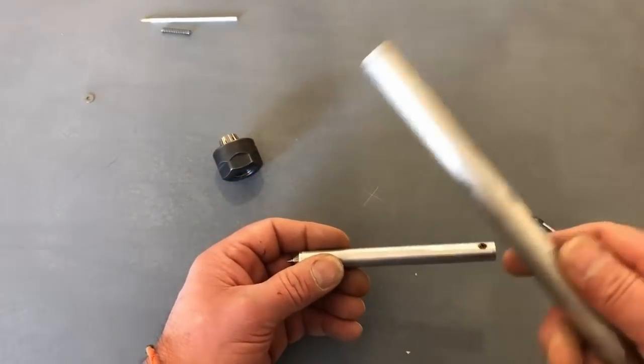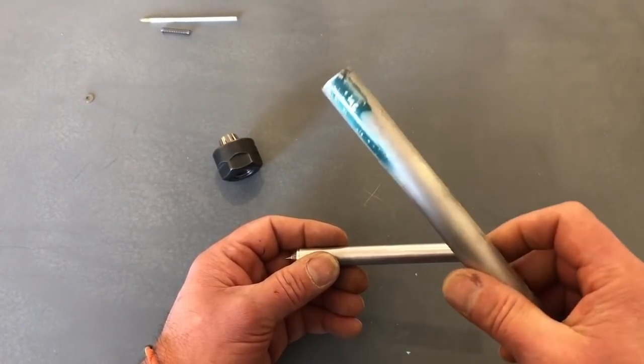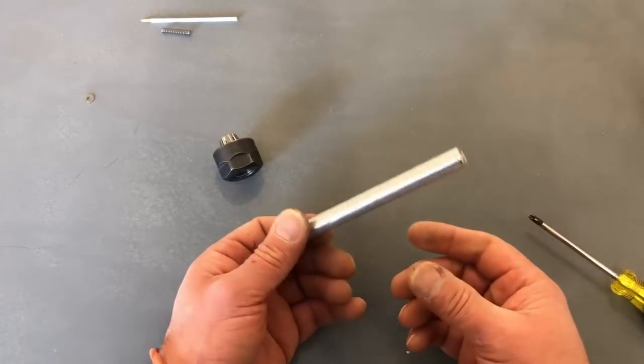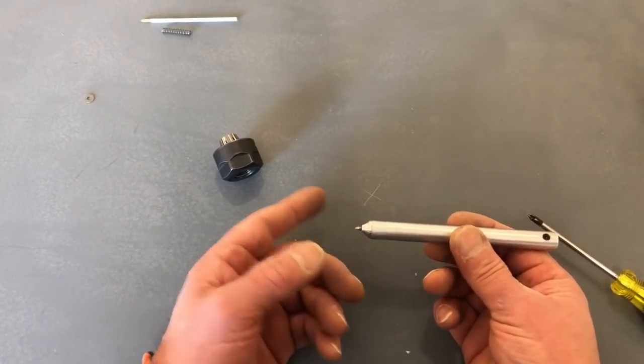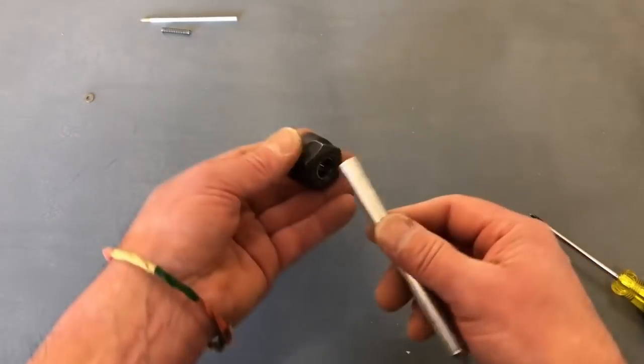The most important thing here was just cutting the length of tubing to the correct dimension — it took a couple of trial-and-error attempts. Just cut it a little bit smaller each time until you get it all to work so that you have spring pressure. And you basically have a pen that chucks right into your CNC collet. The tubing was pretty cheap, pen refill, a couple of magnets — save yourself probably a couple hundred bucks. And you can take this apart and change it to a different color if you wanted to.